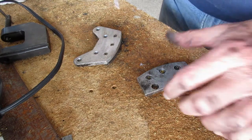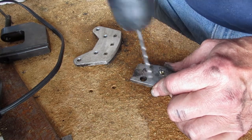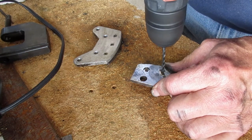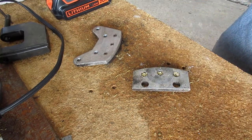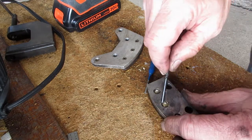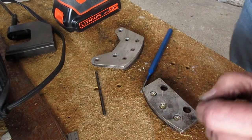According to the directions, you drill out the rivets with a number 25 drill, taking care not to damage the hole. Let me go get a punch to pop those heads off. Apparently I got both sizes — too big and too small — so we'll see what the back of the drill bit will do. It does not want to pop.